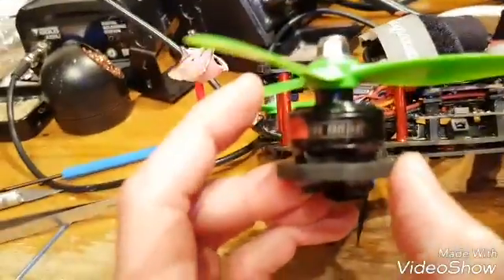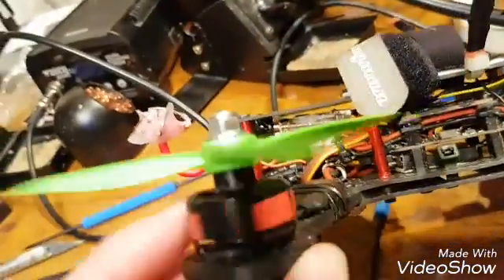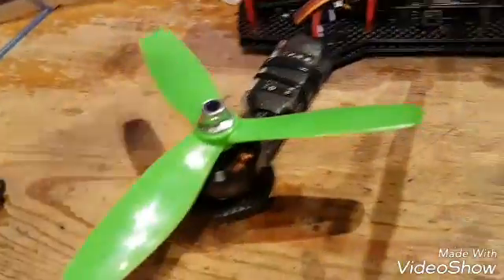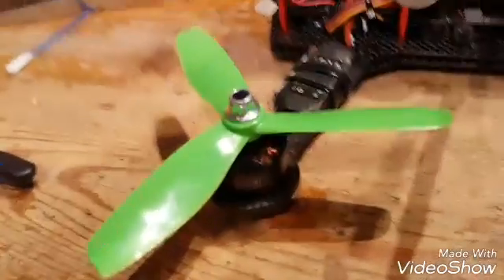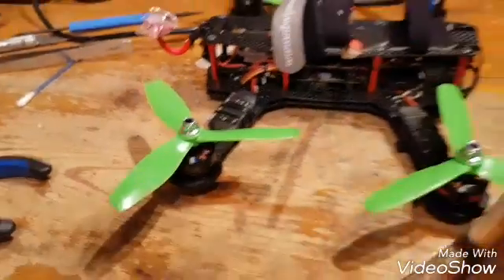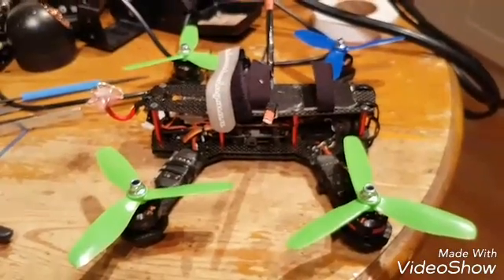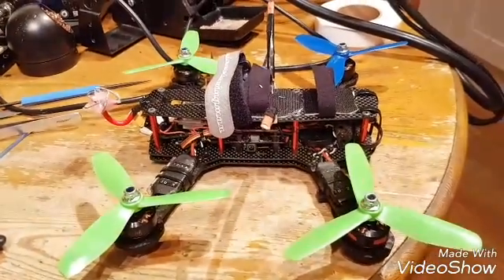I've had mates fix them in the field with superglue and it doesn't affect them. Just check in between to make sure no magnet is poking out. Then put a bit of tape over that magnet so you don't forget to put the circlip back on. When you put the circlip back on, put a bit of Blu-Tac in there and just fanny around with it until you get it on. So that's how I fix these motors — I'll probably fix each one about three times, that is how shit they are. Thanks for watching, hope you don't have to do this, but if you do, that's how you fix your Cobra motors. Cheers, bye.